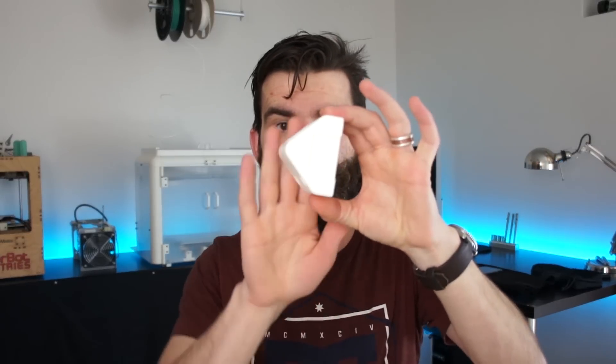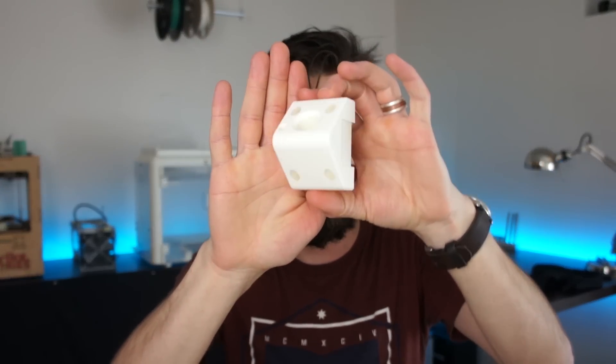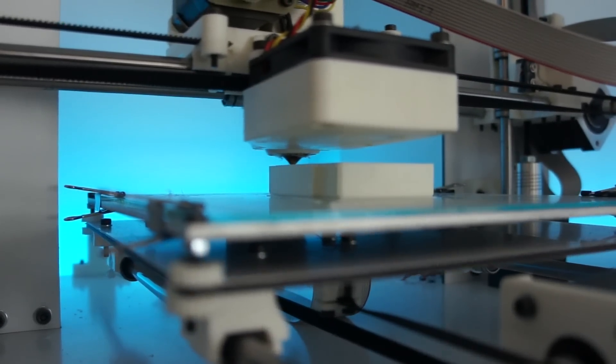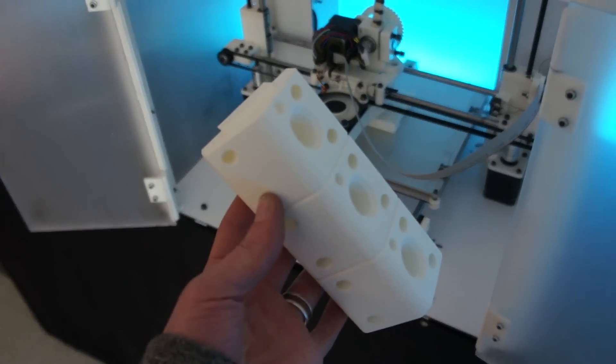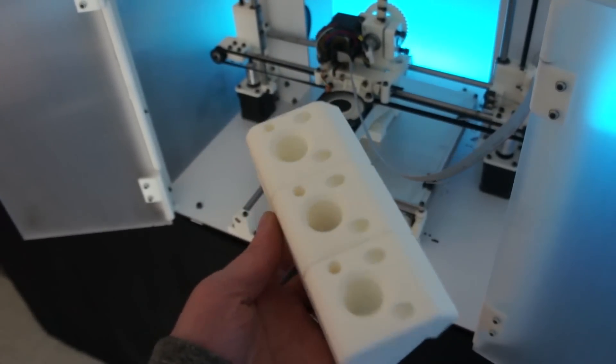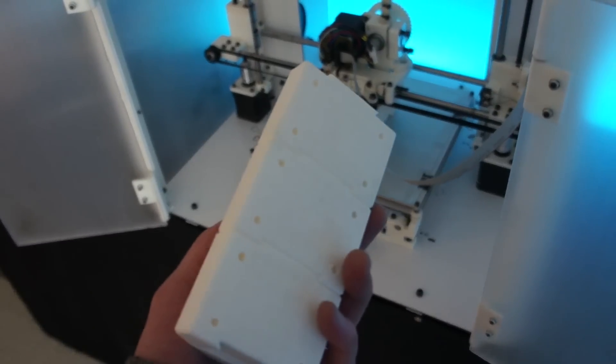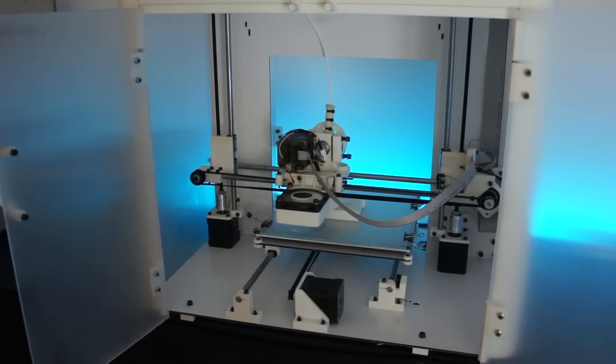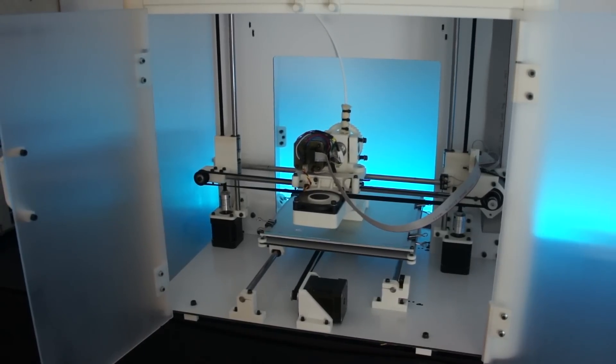What I did is 3D print these little holders. They're just on Thingiverse — some guy designed them, I'll link it in the description below. It's just a 3/4 inch hole that accepts the little taper for the Tormach tool system, and there's an extra hole for an end mill or whatever you want to put. These all dovetail together on either side and you can mount them to a wall, or I mounted mine to a piece of plywood — it holds up to 10 holders. That should take care of my needs for the pens and the dice with a nice, neat, organized way to keep my tools in line.